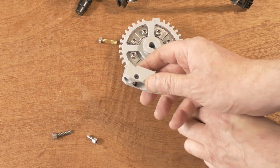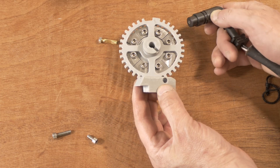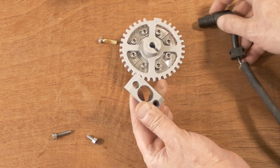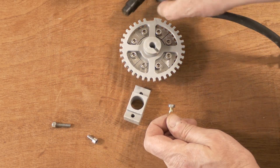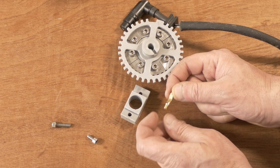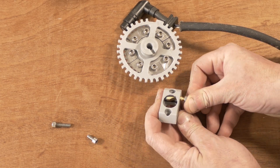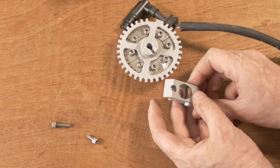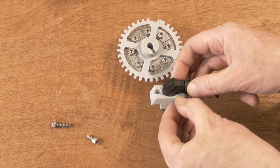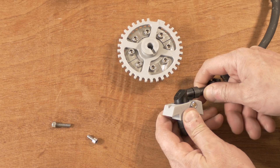That's the design for the little component that's going to hold the crankshaft position sensor. This fits in the modification to the crankcase and gives me a bit of room to position it to get the air gap correct. This is the method of clamping the crankshaft position sensor - it's a common type of fixing used on model airplane carburetors, a tried and trusted method of clamping things together. This goes through a hole in the side, the cutaway is aligned with the bore, and when the sensor is in you just tighten up the nut and that gives a cam action that clamps it in place.